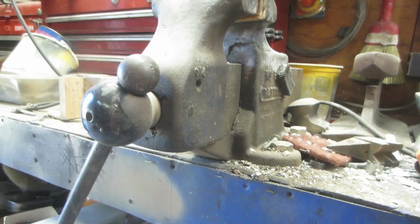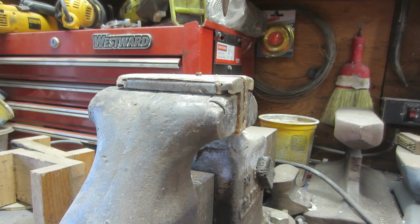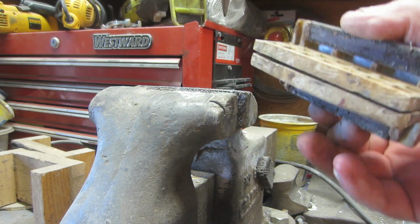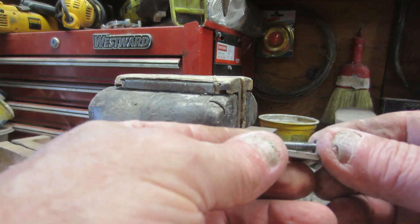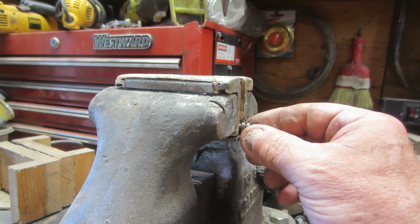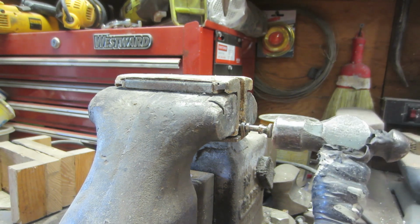And you get yourself a vise, and you have to put some rubber jaw protectors, because you got all this gripping surface here. It'll ruin the threads. You don't want that. So either use that or some wooden jaws. I made these. They work great. Anything to protect the threads, and you just put the threads in there, in the jaws, tighten them up lightly. Let's say that this were on right now. I'm going to tap it on because I've already done what I need to do. So I'll just tap that on real quick.